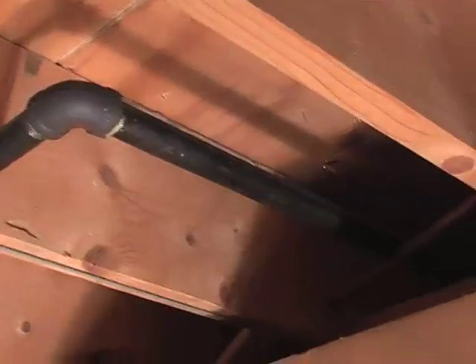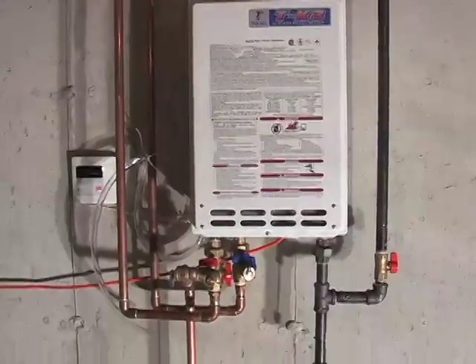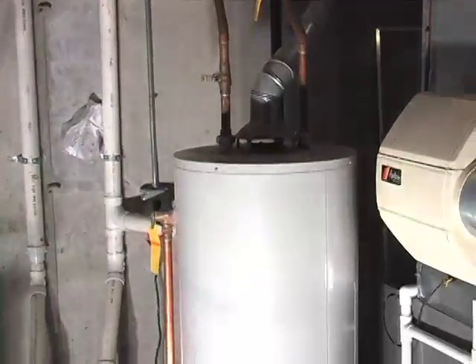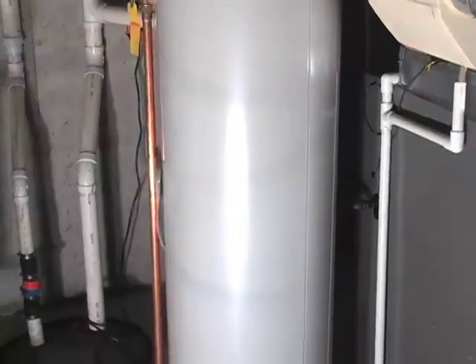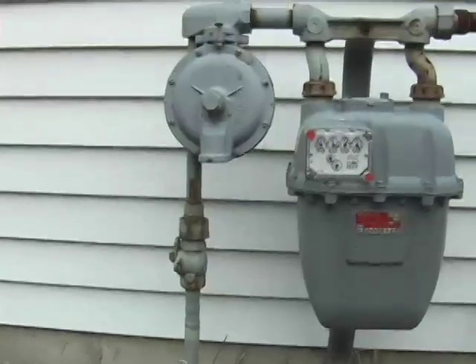The next step in the process is the gas supply. When doing your site survey, please locate the entrance of the gas supply line from the meter into the home. Follow all accordance with the National Fuel Gas Code and all manufacturer's recommendations. In this instance, we have a 199,000 BTU tankless water heater being installed. Already installed in the home is a 110,000 BTU furnace, a 35,000 BTU tank-type water heater, a combination oven-stove, a fireplace starter, and a dryer. Based on our calculations, we have just under 200,000 BTUs already required within this home. By adding an additional 199,000 BTU requirement, we have now exceeded the limit of most gas meters that are installed in everyday homes.